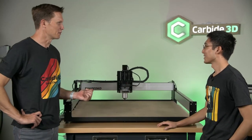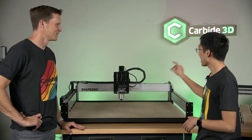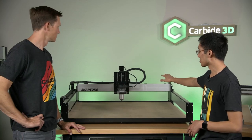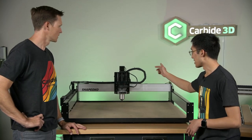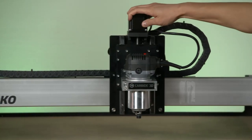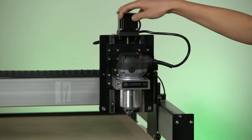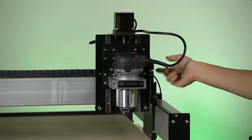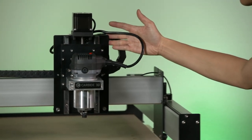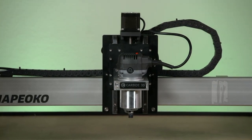It holds that depth of cut much more precisely, so it's easier to do onion-skin cuts. We also have inductive homing switches on these machines now — there's no contact when you go to home, so there's almost no possibility of crushing your switches if you crash the machine. Inductive limit switches are new for us — when I bought my machine there were no limit switches at all. These are great because they're non-contact, which means you can't crash these switches or break them. There are no moving parts on them. And this machine is available in three sizes right now.